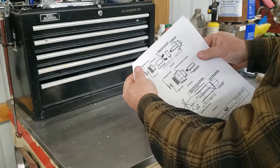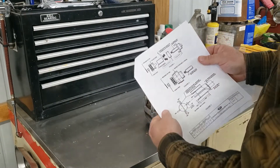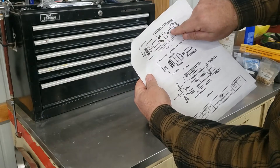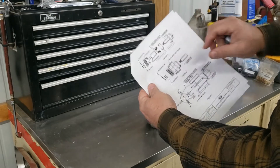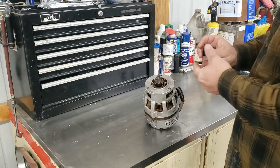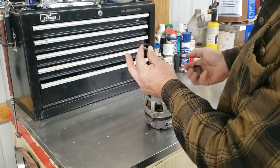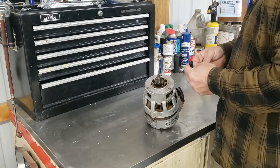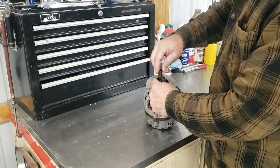The service bulletin on page 3 will give you a nice picture. Figure 1 is the model of coupler that we're dealing with. It'll give you a nice picture of how the final assembly should be done. Take note that these protrusions facing the drive shaft — the tops are towards the coupler, the gear itself. These protrusions will go into the coupler like this, with the gear on the side to match the picture.